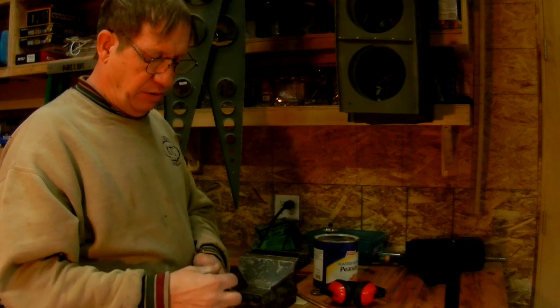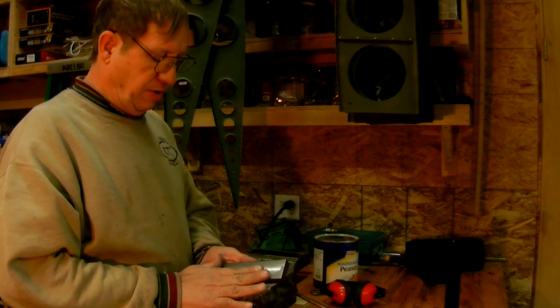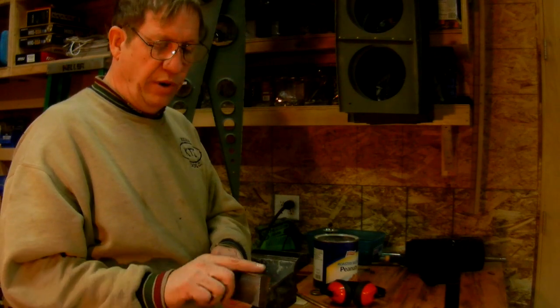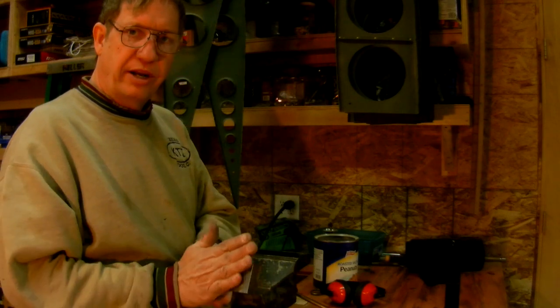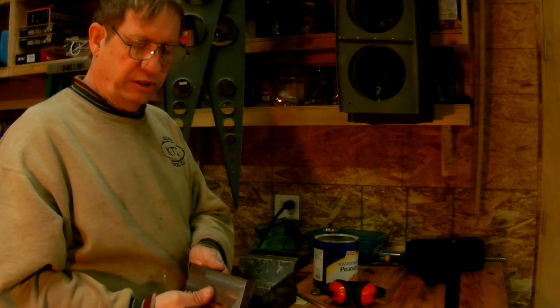It's three-quarter inch wide with rounded corners. I bent one of them around it and checked what the angle offset was. When you bend something, it always springs back a little — you don't get exactly the angle you bend it to. It was off a little more than five degrees, so I put a six-degree angle on here. Now when I bend it around this, I'll bend it six degrees past and it comes out to be just about vertical. It works pretty good.